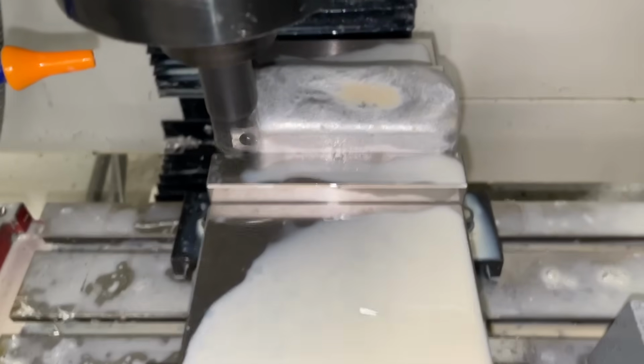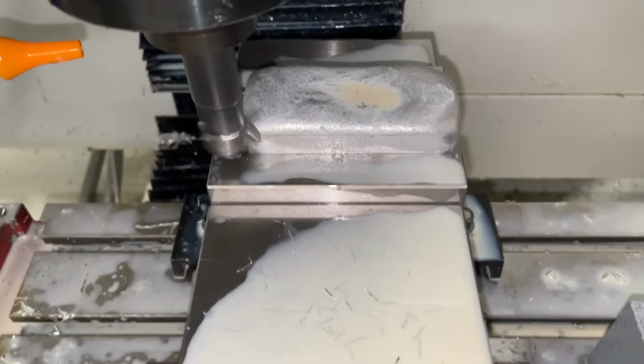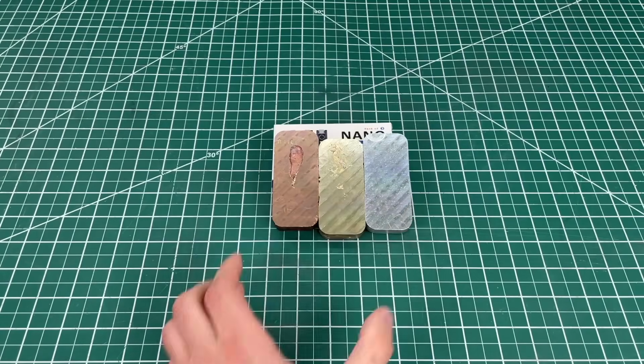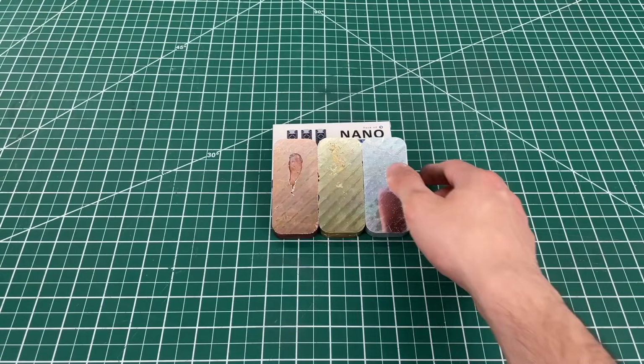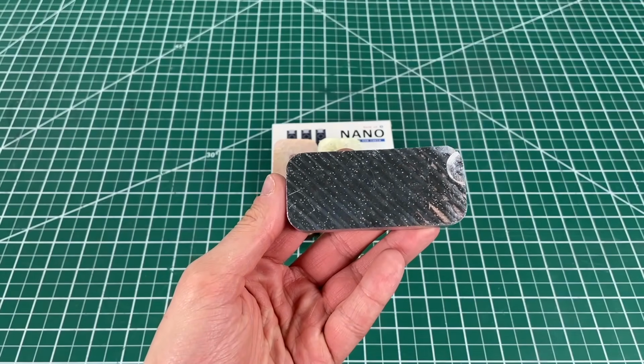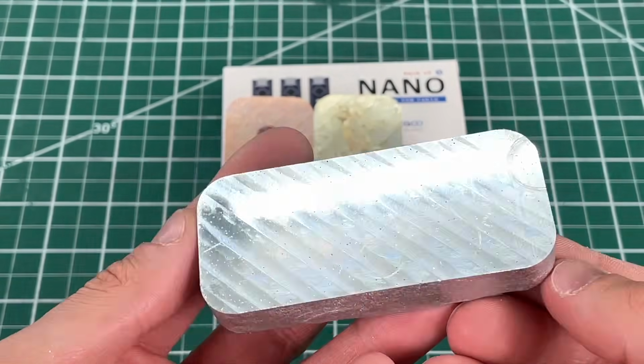We just placed them in a vise using parallels to keep them all at the same height, and we got straight to work. The vibrations made the camera extremely shaky, so we took it off. The final results looked awesome, but nothing's ever quite perfect, is it? Looking at the aluminum, we seem to have all these tiny bubbles inside, and we have no idea why. We're not sure what we did that may have caused this.